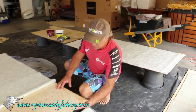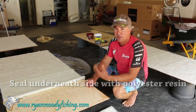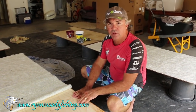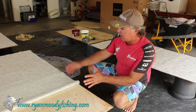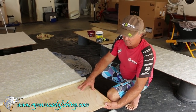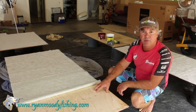On the underneath side — I've already done them — we've coated that with polyester resin and we've thickened it up using a thickening agent, or talc, talcum powder, industrial talc. I've already done the undersides, so shortly I'll show you how we mix it all up and get it underway. Then we turn it all over like we've done now and we're ready to put the glass on the top. We've sealed the bottom side with polyester resin and now we're going to get ready to brush on the top side and start rolling in the mat.